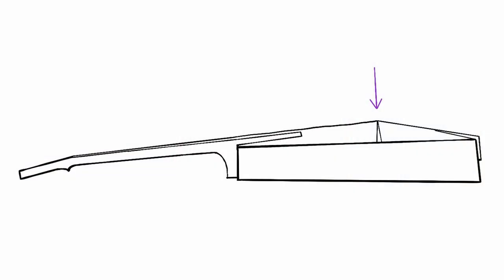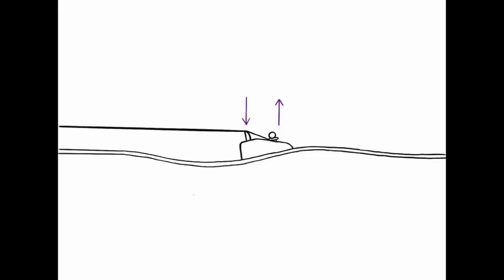Bracing is going to vary largely based on what type of forces are acting on the top of the instrument. On an arch top or a guitar with a floating bridge and a tailpiece, your forces are acting down into the top, as opposed to a pin bridge or a bridge with a tie block, where the principal force is actually torquing on the top. So all the bracing needs to accommodate those forces in as efficient a way as possible.